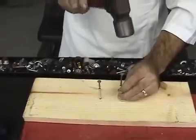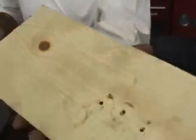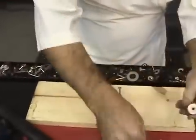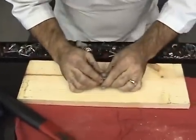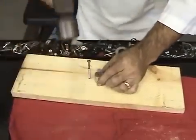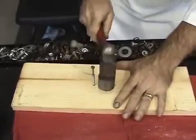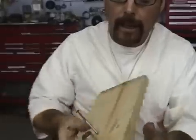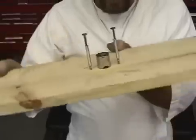You can see where I kind of went through all the way. Take the other one, same thing. Bend that one piece of the spring over like that — see that? That way the coil can sit in there. I'm just going to pound him in there, go all the way through where he sticks out — see that, sticking all the way through. Next thing, take our special handy-dandy magnet here. If you notice, there's a hole in the middle — stick that nail in there and then pound him in. That's a strong magnet! Now we've got our magnet and our little springs to hold the coil in there. Everything's locked in place.